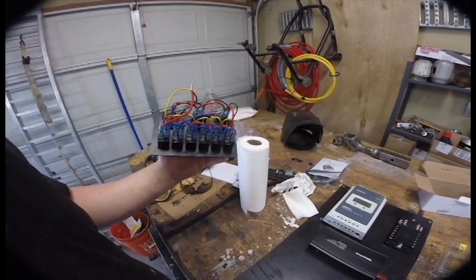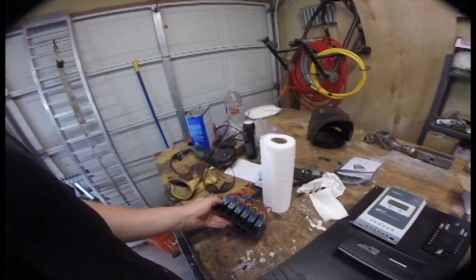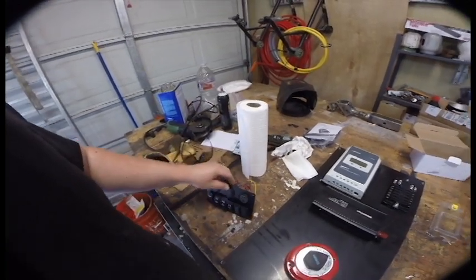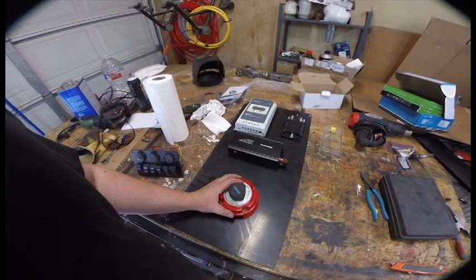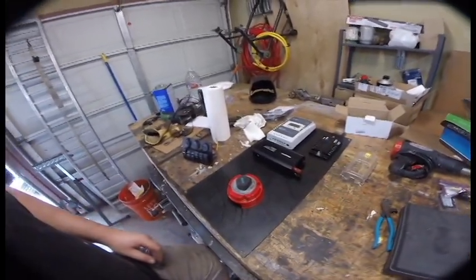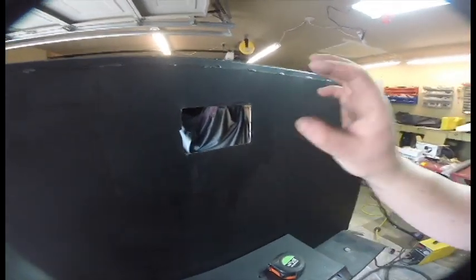The back of this panel uses pretty solid-sized wires — I'm actually fairly impressed. The blue and yellow are for the backlighting, and the red and black are for the actual 12V power. You can see spade connectors for the output to each device. Unfortunately I was going to mount these using M4 nutserts but the nutsert tool is on its way and won't be here until tomorrow.